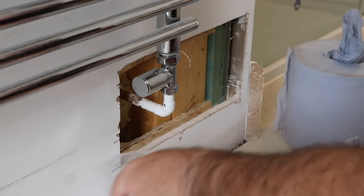With the towel rail reconnected, I can tighten everything up, making sure the bleed valve on the radiator I've been working on is closed before I fill it up. I can then open the bleed valve and bleed all the air out of that one radiator until it's absolutely full. With it full, I've put the heating on, which naturally pressurises the system to its highest amount — more than when you top it up cold — which is a good time to check for any leaks. All the other radiators can now be opened and the whole thing goes back to normal.